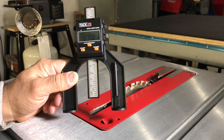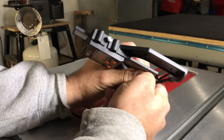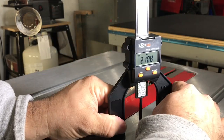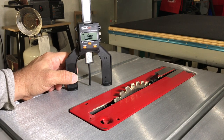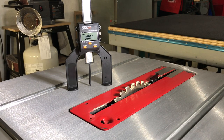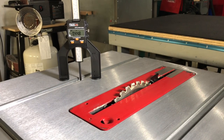Something else you can do with this: you can set router bits or router bit depth on your router. It comes with a little pin that goes in this groove in the back. So we'll just zero it out real quick. Now if you want to measure a hole that you're drilling with your drill press, or a groove cut with your router or table saw, you just put it over top and the little pin goes down and gives you an exact measurement of how deep that hole is.